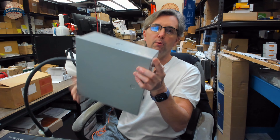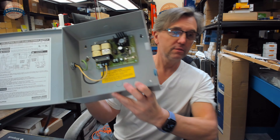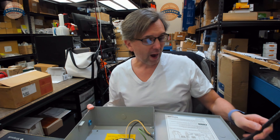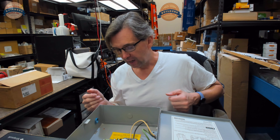Before we get started, I'm going to ease into the power supply and how we check for voltage with a PS861, which is a simpler power supply. This is an actual call from a customer who says they've been sent a power supply and there's no output voltage present. The PS861 has a couple fewer things to be concerned with, namely any jumpers that need to be configured correctly. The client could possibly be missing the jumpers, and that could account for the lack of output voltage.